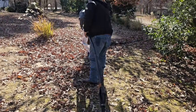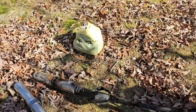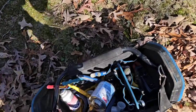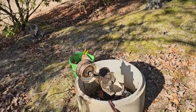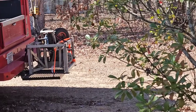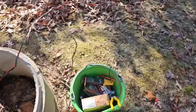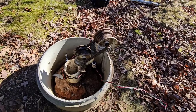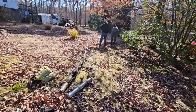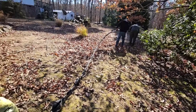He went and got us some rags, so they're going to be cleaning the pipe and wire all the way down the full length, and I'm going to sit here and get this all prepped up. Ironically, we brought the electric pump puller, but it was just too fast to pull it out by hand. Even though it was 380 feet, it's just so much faster to pull it with my two-wheel wonder — especially when you've got somebody willing to help. Three of us pulling on that thing, I think we had it out in about eight minutes, start to finish.